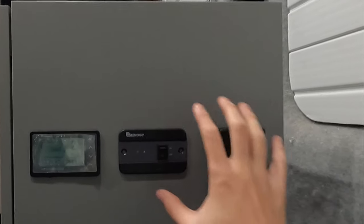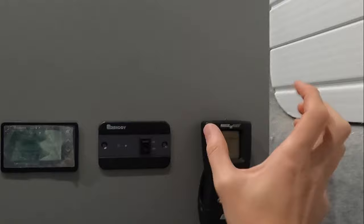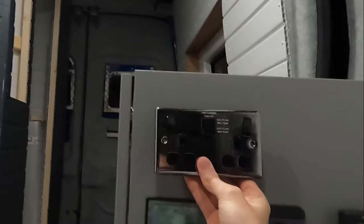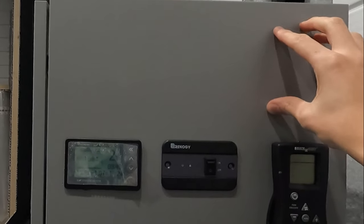It's been a couple of days, but all the electrics are safely in the cupboard. I've attached a few accessories on the outside: my Renogy Smart Shunt monitor, my inverter remote, and the MaxxAir fan remote. All that's left to do is fit my 240-volt socket and the remote control for the rest of the 12-volt setup. That's already wired up on the inside, so I just need to drill a hole and flush-fit it. Right now I'm doing the 240-volt socket.